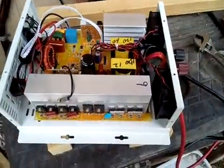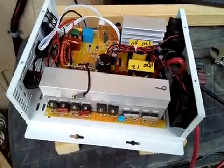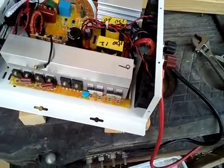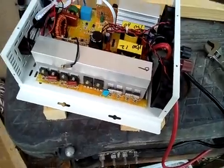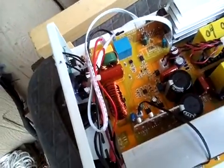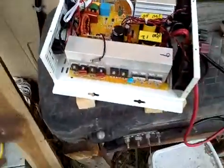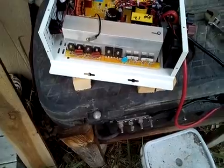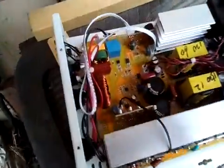On the other inverter, there's a diode that looks blown — that blue one right there. Also the fuses were melting on the other inverter, and one of the wires appeared to be kinked between the lid and the bottom part. This new one is built much better — it's not as compact or tight, so nothing can really kink.